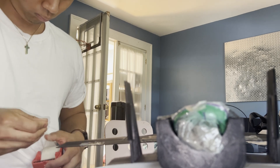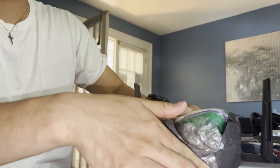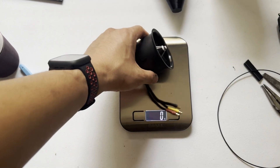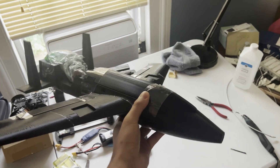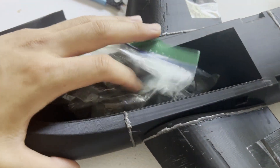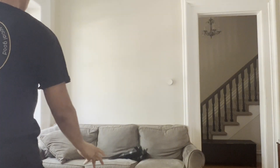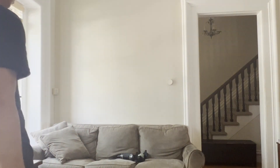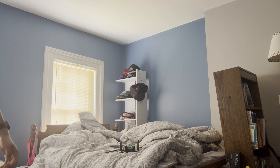Before I tried to fly it, I did a simple test that someone on my last video recommended. After I built the frame, I loaded it with plastic bags filled with rocks to stand in for components like the battery, the EDF, and the Arduino. I taped down the bags to where I thought these components would go, then chucked the plane into a couch to see if it glides. In the two runs I did, the plane actually looked like it glided pretty well, and that was basically the extent of my aerodynamic testing for this iteration.